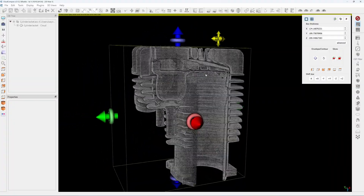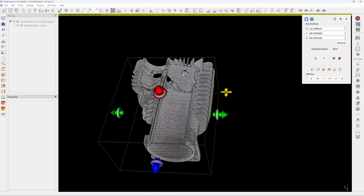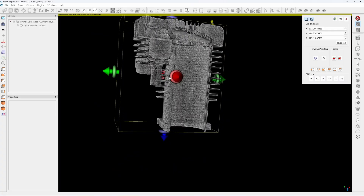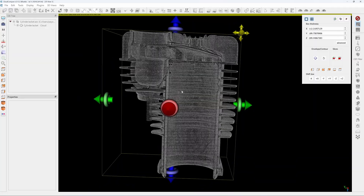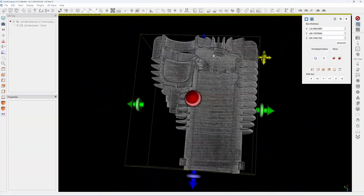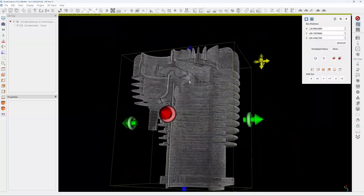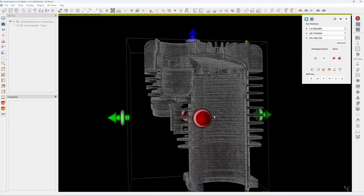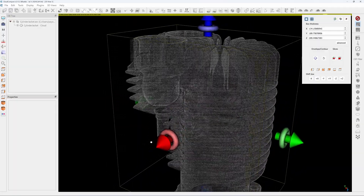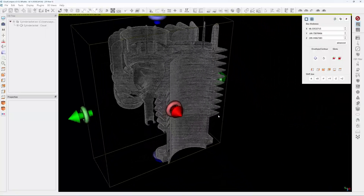On the exhaust side, I'm glad the scanner can reach the bottom of the cylinder and top of the valve cover, because it has a curvature. I don't think it has a constant thickness — when I slice to here, this part is thinner. I can see the trajectories. Even though the scanner cannot capture all the inside, because it's a very deep cavity, I can guess what the shape of the cylinder head would be. The valve seat is fully captured — this is enough for doing the reverse engineering. I think I can reverse engineer this part.